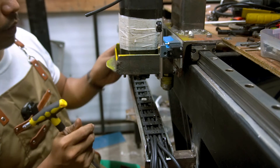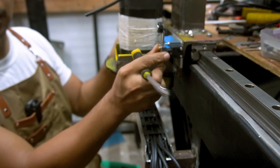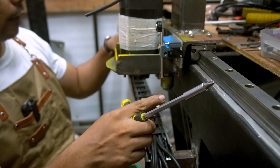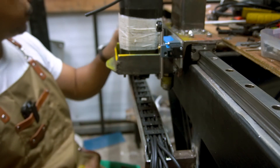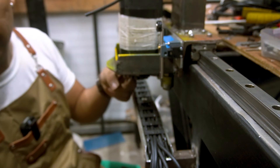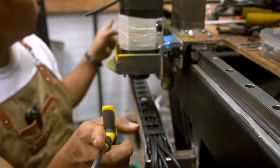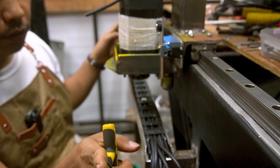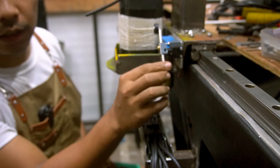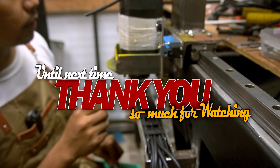Tight, tight, tight — I think this one is solid. This is going to be the setup, and I'm just going to re-orient this lever pointing down. The next thing is going to be installing the chain, and on both ends of the linear rail frame I'm going to install the tensioner for the chain and also the plate where this limit switch is going to hit. So that's what I'm going to do next.